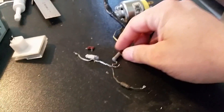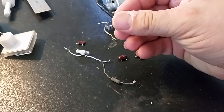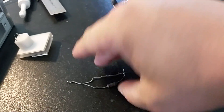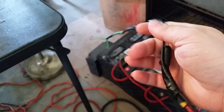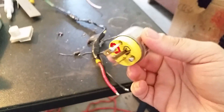He got the 68 ohm on there for you. Let me take you over here and show you what I did to it. Pretty much every single capacitor in the whole amp was the wrong value for this model. Even the padding resistor was the wrong value. There's your blown bulb right there that I replaced. Also, I didn't like the way these two leads on the variable were bare — I don't even know how they weren't hitting the top of the case. Here's your power wire; I went ahead and replaced it and I'll send that back to you along with the plug.